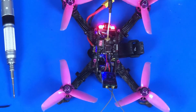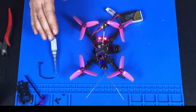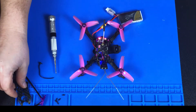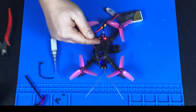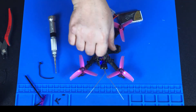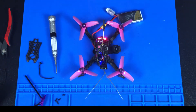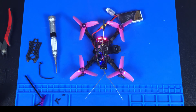It's not intuitive; it can be confusing, so I hope this helped and cleared up how to set your VTX. I just wish they'd thought it through a little bit more, because the moment you put the top plate on you can't see that display — and even if you try to peek through the holes you really can't see it. You'd basically be trying to set this transmitter blind unless you take it apart to see the LCD display. I hope this clarified how to set up your VTX for its power, band, and channel.